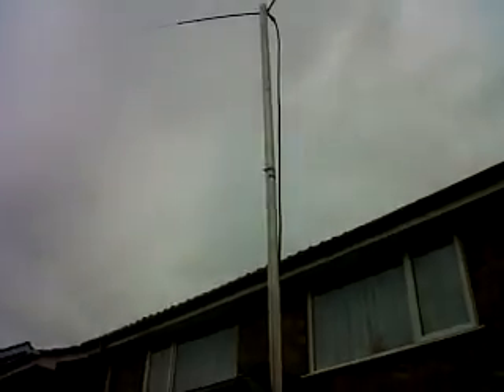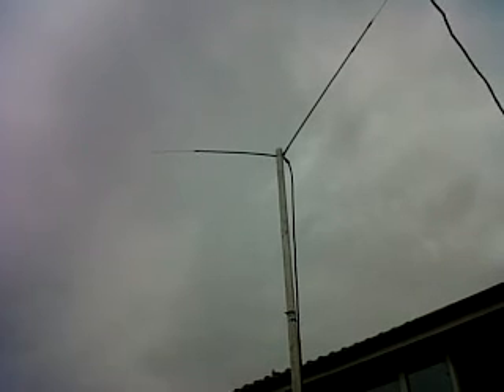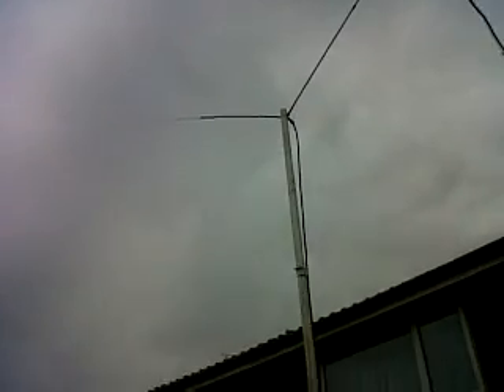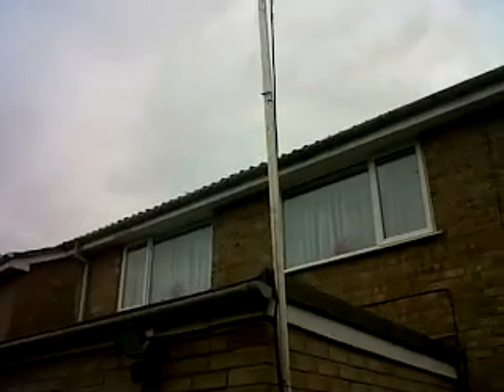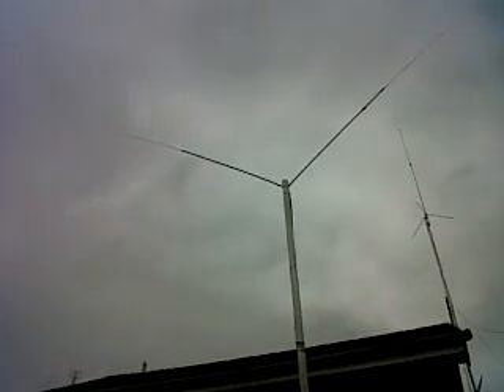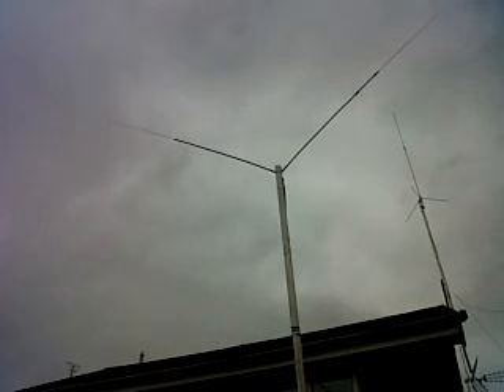All the way up to the antenna, where it's fed basically just with 50 ohm coax — no balun or anything. It goes into a V-piece so you can screw two three-eighths whips into the V, and then there's an SO239 socket for your coax. I'm yet to tidy all this up — I will cable tie everything later and make it nice and neat. I can turn it round; just worked into Russia with it.